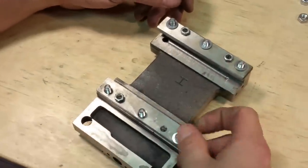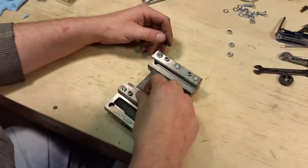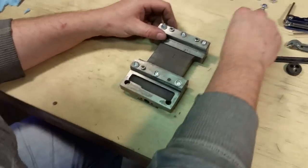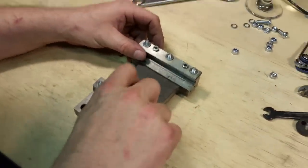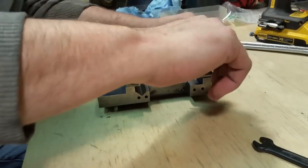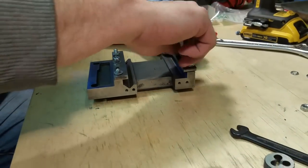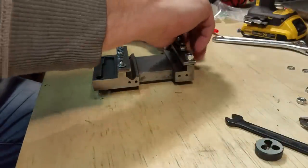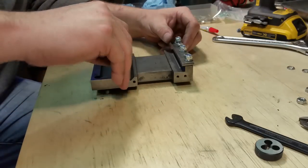And you can see these are the nylon top nuts, and maybe we'll even grab the threads; they won't loosen out. Now these will be 10 millimeter, and you can adjust them, and you won't need the Allen wrench. Just grab the 10 millimeter wrench. Now I won't snug these all the way up until I get it on the bed. And then I'll take the wrench and snug them up and move the carriage by hand left and right.